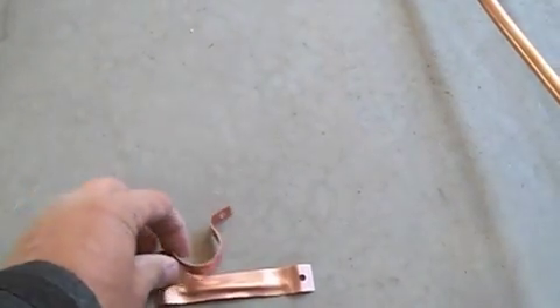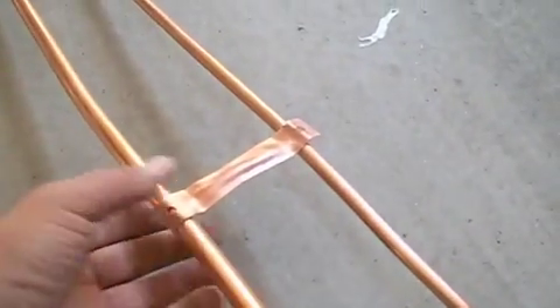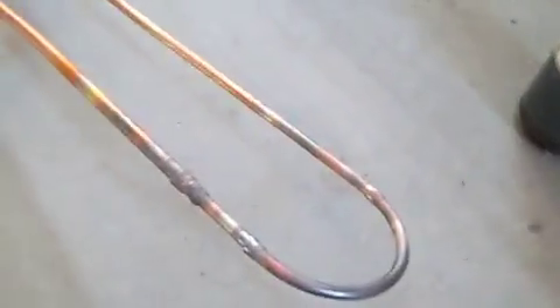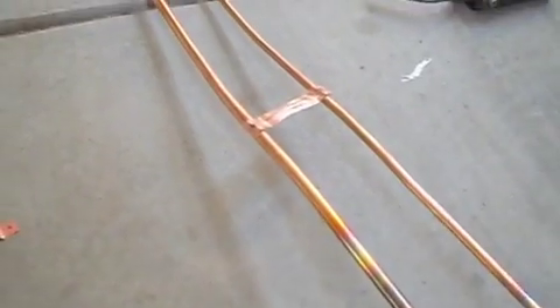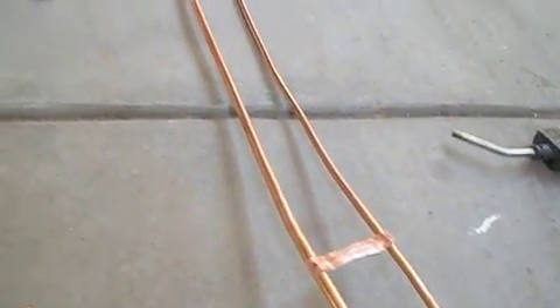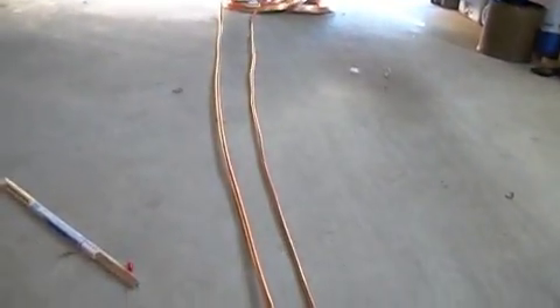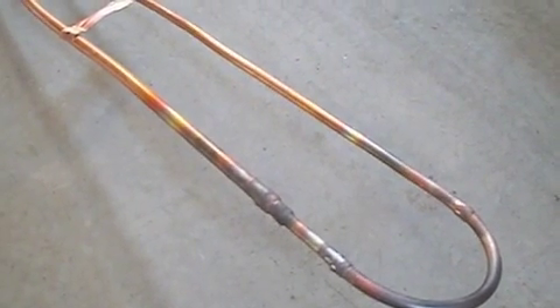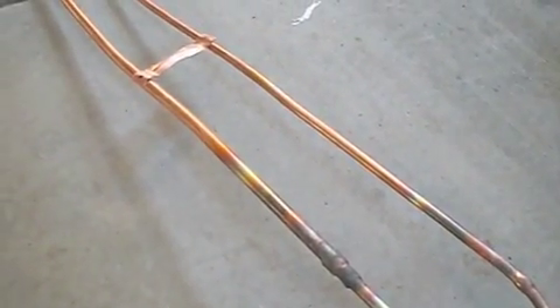On this step I'm going to start adding spacers. This spacer I made from one of these, which is pretty common in plumbing — it's a one-inch mount for one-inch copper tubing. That way it doesn't scratch the tubing since it's made out of copper itself. I made these so they fit real snugly on the tubing. I'm not going to use silver solder on these because they're not related to the refrigerant pressure — they just hold the two pipes apart while going down the hole. I'll put one every four feet, then add tar on the outside of the tubing to protect it from the soil.